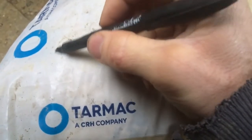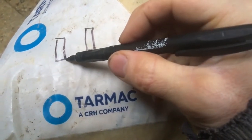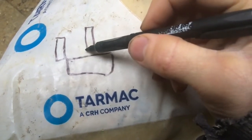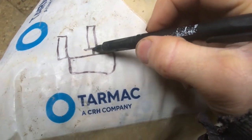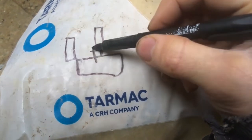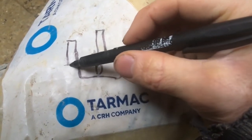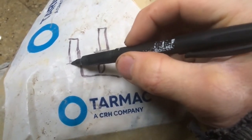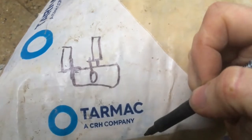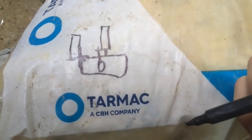If you're looking from above, you'd have one timber there, one timber there set in slightly. The brick sits like that, flush with this one. Then you've got a piece of angle here that sets the brick off this timber and protects it from the damp. And then a tie from that to the centre hole. And you've got a second piece of angle here which defines this front face. Then you've got a third piece of angle which just puts a small gap here that sets this brick off from there. And you've got to do all of that all the way up the building in regular steps of 75mm.